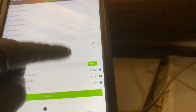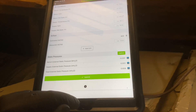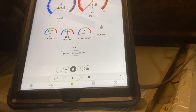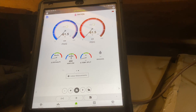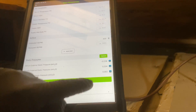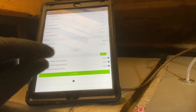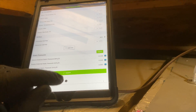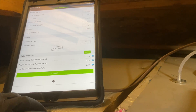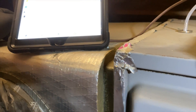When you also have the air probes, they measure temperature, wet bulb, and dry bulb, so it automatically enters all that data and helps you calculate airflow properly — that's pretty cool. In MeasureQuick we're getting 0.563 inches of water column, which is a bit more precise than the Field Piece app. MeasureQuick lets you build reports of the entire system — amp draws, efficiency calculations, all kinds of stuff. I highly recommend it.